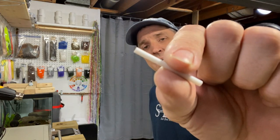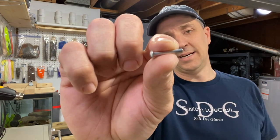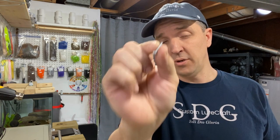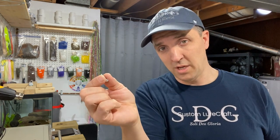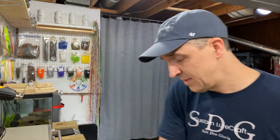You can use one of two things: a Teflon pin, or a metal rivet pin — shorter style. Art Fowler sent these to me and they work just right. The head's just a hair big but you can squeeze it shut, works really nice. The other thing you can do is take the pins that the mold comes with and just cut them down to size — you can even cut them at an angle so it angles with the head. But I'm going to use what Art gave me, slip this in there, and let's pour some lead.